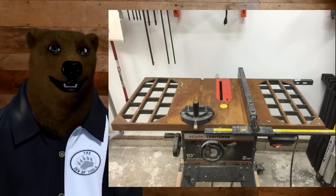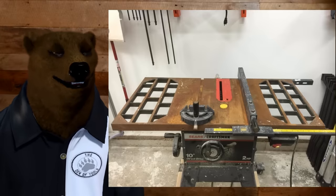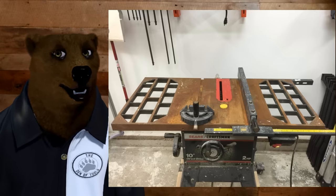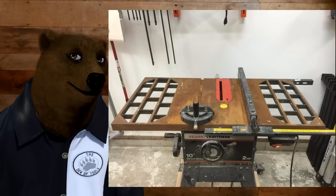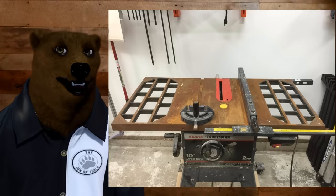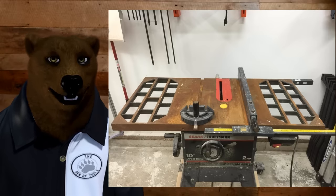And this is another thing I've used it for: light surface rust. It's decent as a rust remover and it has some lubricating properties, which makes it great for surface restoration. On light rust, you spray it on there, you let it soak in, and you go in with a steel wool pad, and it just pulls that rust right off and helps you resurface that to get to the bare metal underneath.